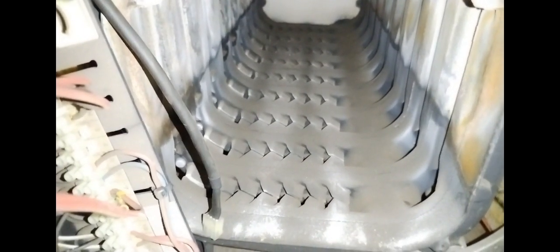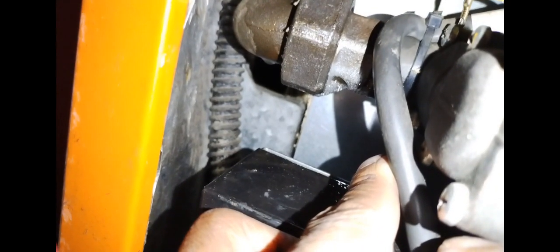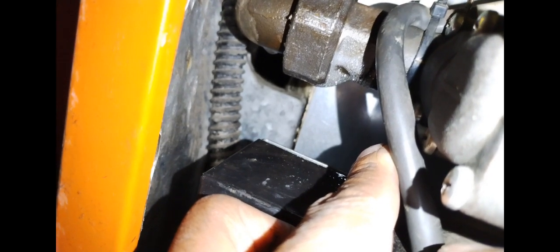I don't think it was calling for heat properly. And on the other Regency boiler that was at full, I believe the gas valve had a problem. So I did some work, and then I was just making sure that I had no leak. I had a slight leak on the gas valve, so I had to put some jointing compound on there. And then once that was fine, I managed to get one of the units to light. But the only problem was the ignition wasn't quite right. So I think that the gas valve may need adjusting, but it's something I'm going to work on another day.